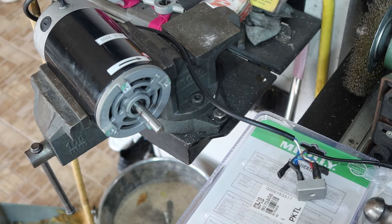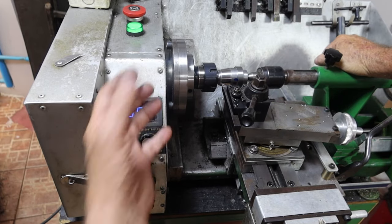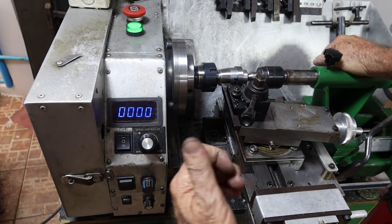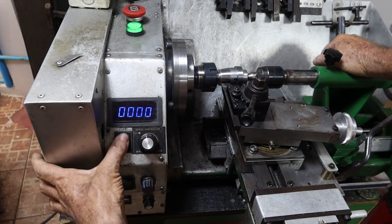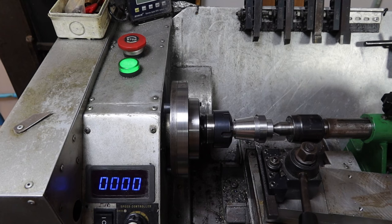Running it straight into 220 volts through a plug — the question is will it do that in the machine. I'm starting to get the irrits with this thing. I plugged everything back in with all the covers off and it was working perfectly, so I put all the covers back on, fired it up ready to make video — and nothing. Truly hate electrical problems. After a couple of false starts I think I've finally found the problem — I thought maybe it was the switch, so I decided to replace it. While I was doing that one of the wires broke off the potentiometer, so I re-soldered that back on and it looks like it's all good now.